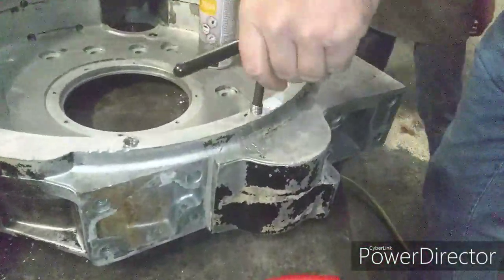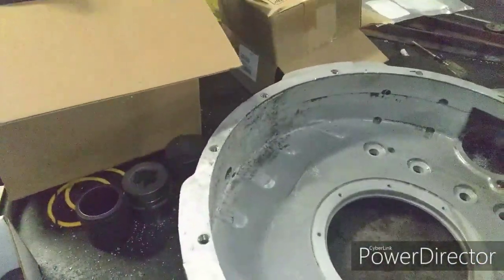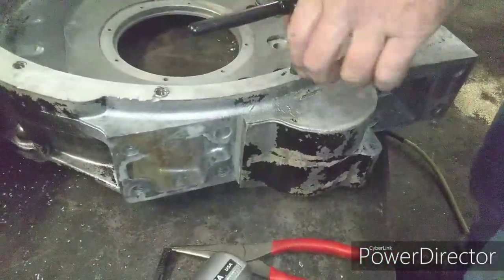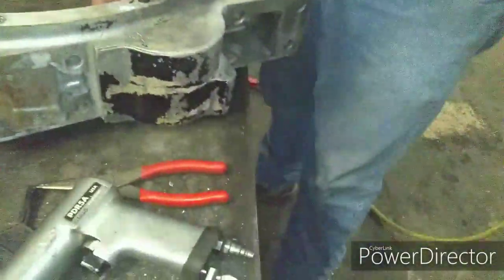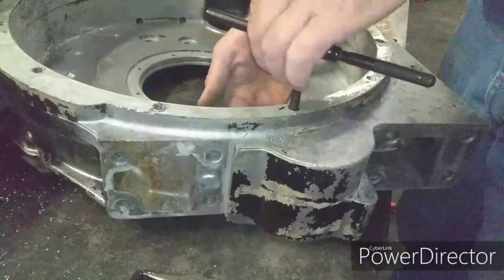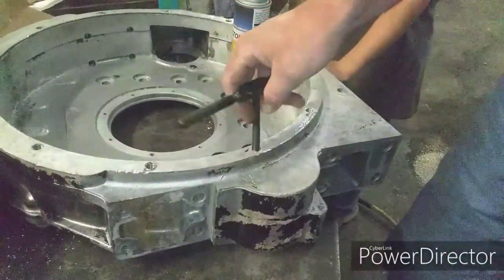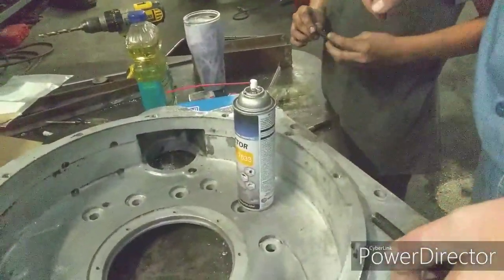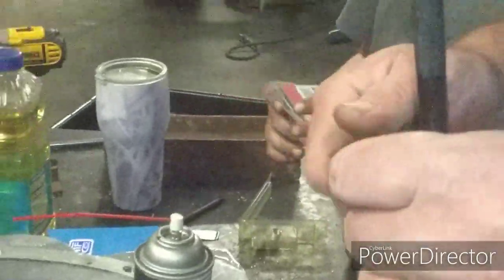This is why you never use the Permacoil brand. Say that again. This is why you don't use Permacoil brand thread inserts. Fresh insert. You have the Helicoil brand? Well, that's what we're going to use in the next hole.